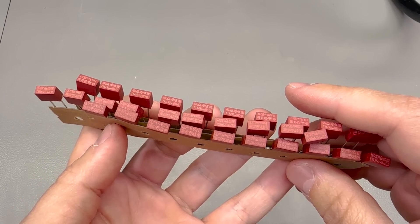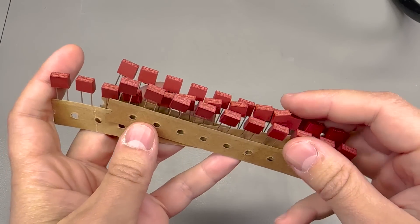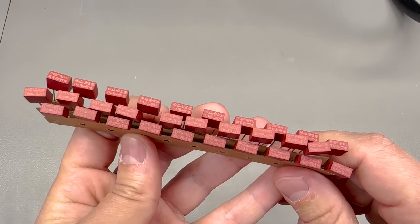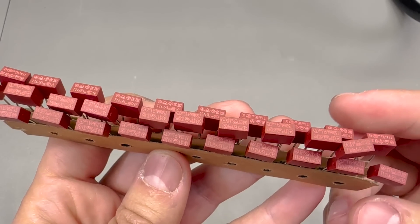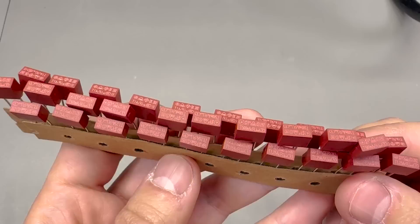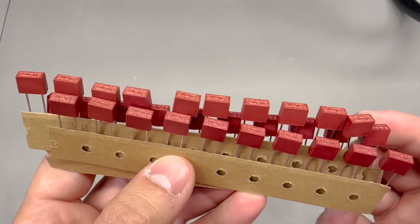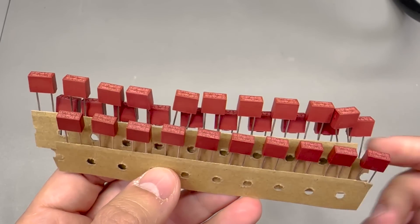Next up I have an assortment of through-hole slow-blow fuses — well, not a full assortment, just three values: 500mA, 1A, and 1.25A — which are the most commonly encountered values in the input section of small compact switch-mode power supplies. These are AliExpress fuses so take the ratings with a bit of caution, but they do come in tape reel packaging and have markings for VDE and UL testing, which inspires some level of confidence. I'd say these look better than common low-quality unmarked fuses.